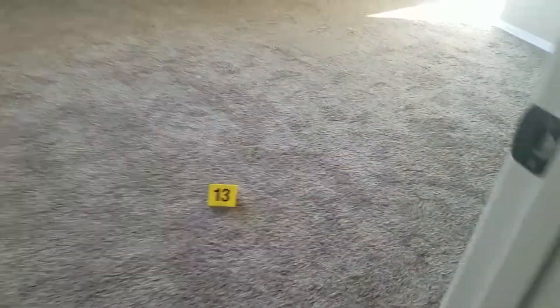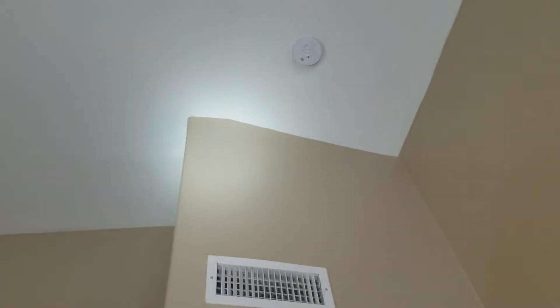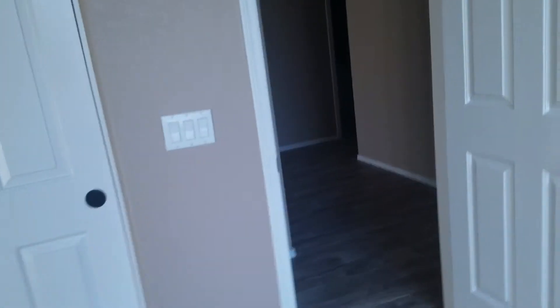Number 13 is slight cracking in the drywall right there in the corner — another indication of settlement. We're seeing the weakest parts of walls: doorways, windows, and thresholds. There is a little bit of separation here. Some of this is typical to this type of stem wall construction, but over time, homes that are compromised with vertical breaks in the foundation walls will continue to show these signs.